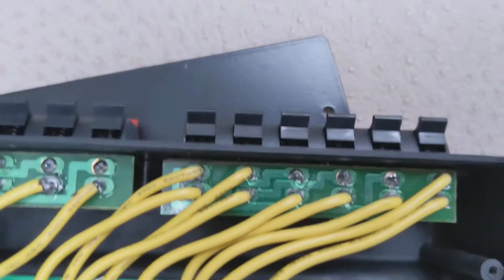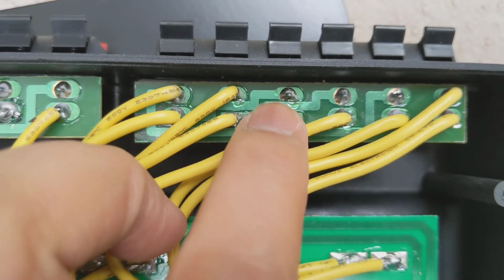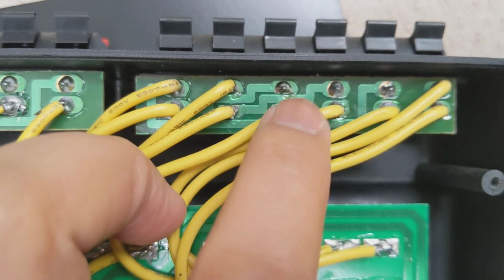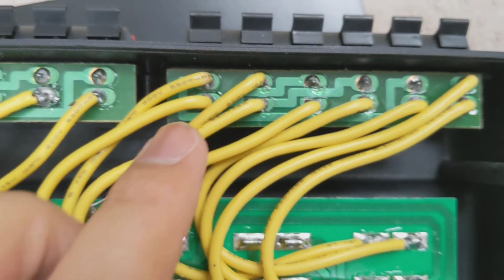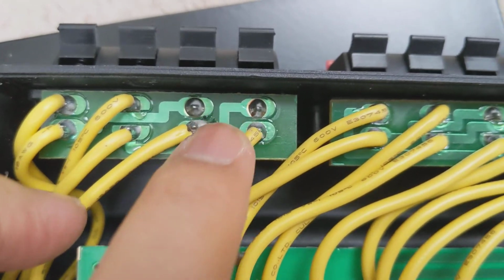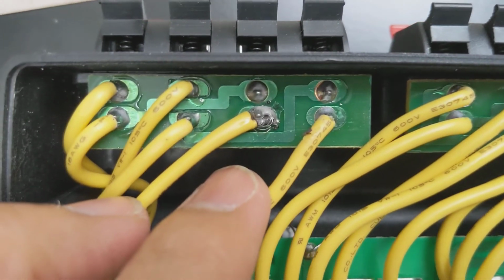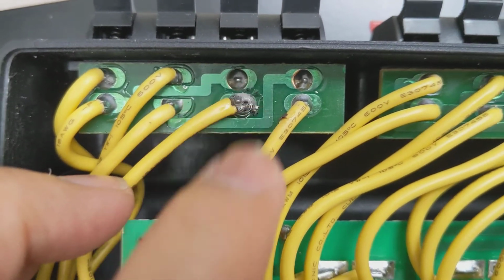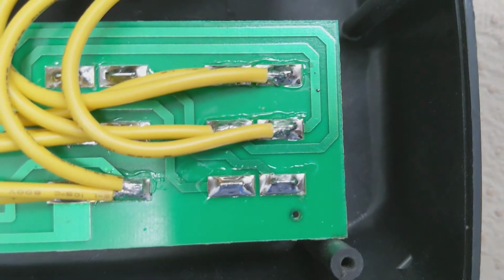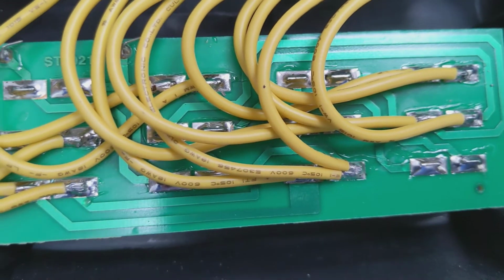circuitry or circuit board, and I'm not quite sure where or why, but you can see that there's not much gap between the soldering pathways from one to the other, so that's why I suspect there's some bleeding going on here between the speakers where one is playing. The soldering isn't done neatly. It's quite thick blobs of solder on it, so I suspect that something around here is crossing over and causing the wires or the sound signals to bleed through when you're playing one channel and the other channel's off.